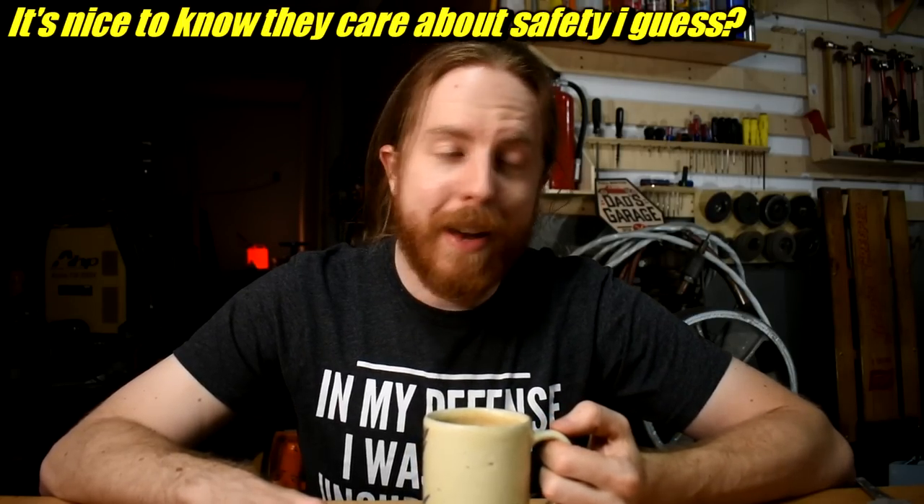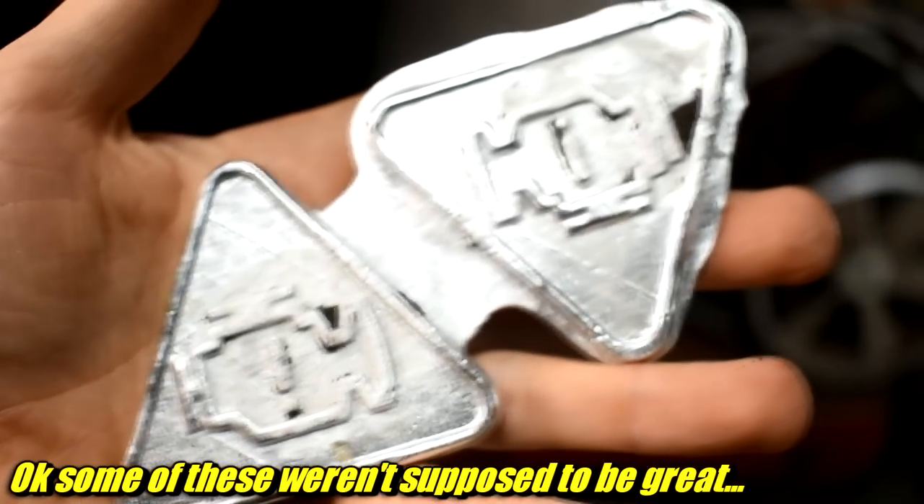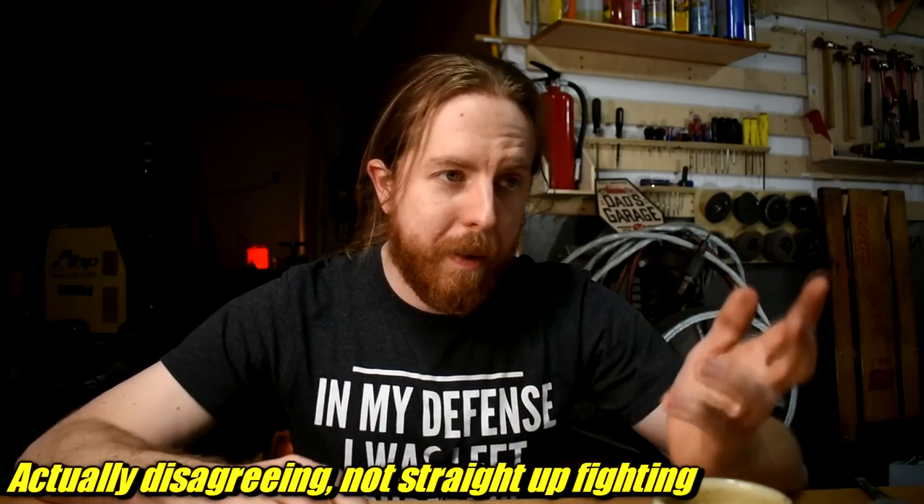So what's the problem? There are plenty of reasons why my metal castings don't turn out as nice as they should, but today specifically I'm going to talk about pouring temperature - the temperature the metal is when you pour it into the mold. It doesn't just have to be liquid; it actually matters. If you do some reading up on the subject, you'll find the universal internet research outcome of everybody disagreeing. Some people attribute a whole bunch of casting problems to pouring at the wrong temperature, and others like John Campbell in this gigantic book say that most of the flaws are caused by poor gating or pouring techniques. I'm even more confused now. And there's no way I can even measure the temperature in my giant propane furnace, or any of those propane furnace kits you see. So there's no point in even looking up the proper pouring temperature of all these metals.